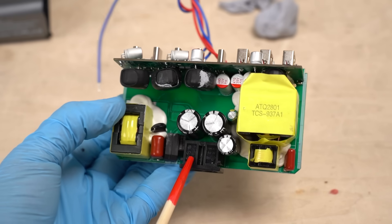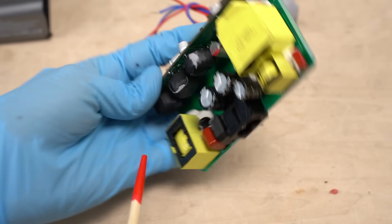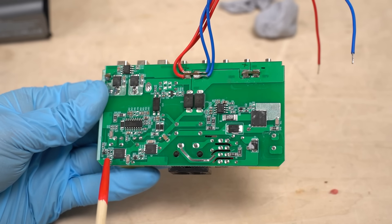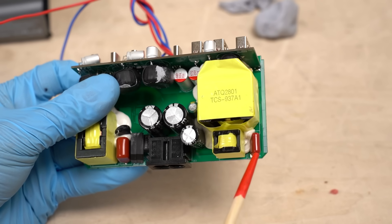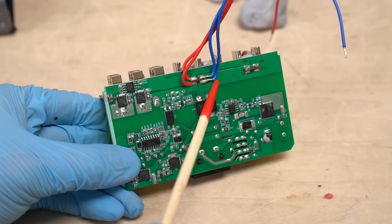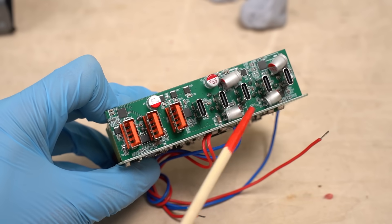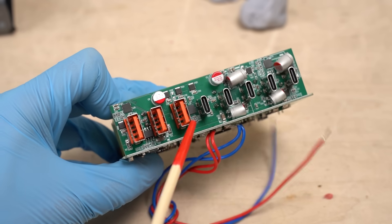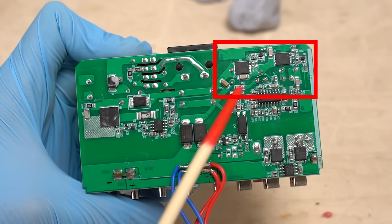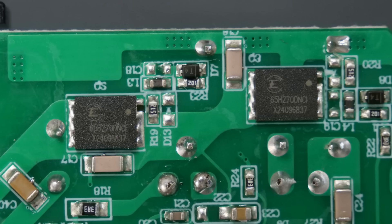The circuit configuration is that of a typical power conversion circuit. The power input passes through a diode rectifier, then through a power factor correction (PFC) circuit. After that, the voltage is lowered while being isolated by an LLC converter — the controller, power semiconductor switches, inductor, transformer, and film capacitor (the C in LLC) are all visible. The current then goes through the synchronous rectification circuit to the USB board, where the voltage is fixed at 28 volts to align with USB PD-EPR. Each USB port's voltage is then adjusted individually by a DC-DC converter on the USB board. The product name includes GAN, and I confirmed that gallium nitride power semiconductors from Chinese company Corenergy are used — one in the PFC circuit and two in the LLC converter section.